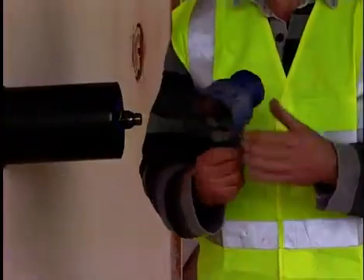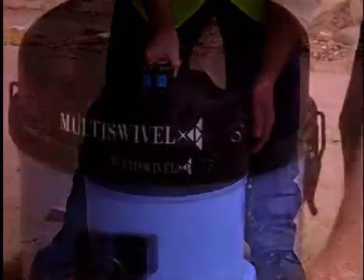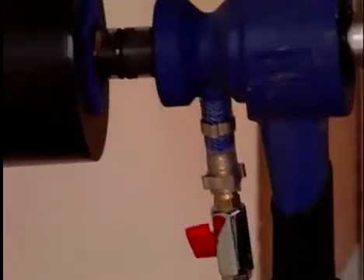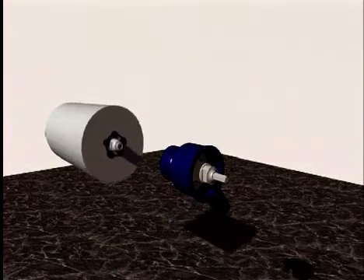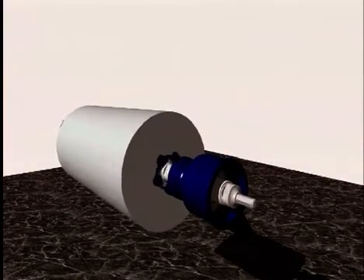In which case, you simply reverse the chamber, insert the reservoir into the vacuum unit, attach the water supply, and switch on the in-built pump, and you're ready to wet drill. Where larger core bits are used, it's a simple matter to insert the plug ring into the rear apertures to seal the bit, allowing the water supply to be directed under pressure to the point of contact, ensuring faster drilling times and less exposure to hand-arm vibration.